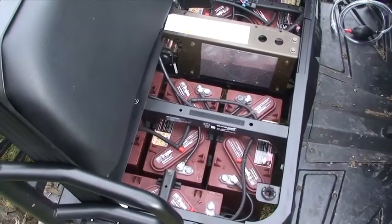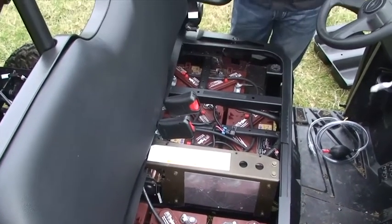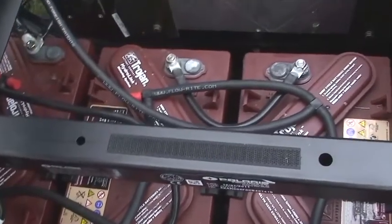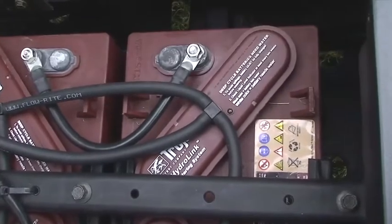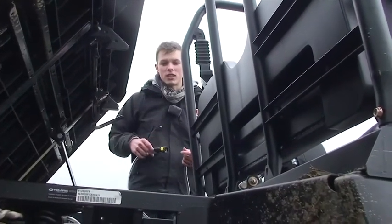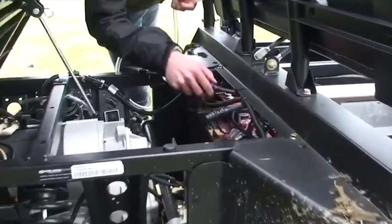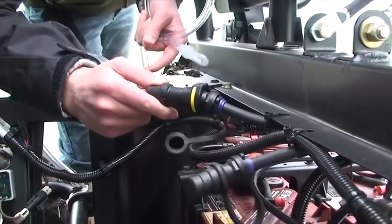In here, just like the Avid actually, we've got eight deep cycle batteries — so they're long life. You might notice it's got this clever water system, which means you can fill them up. These caravan-style batteries have a watering system with a colour code here, which indicates when they need filling. Back to the water pump we found under the bench seat — it's just a case of squeezing yourself in, taking the end off, and connecting the hoses. There's one each side to fill the four batteries either side of the machine.